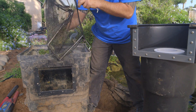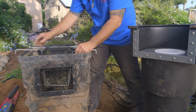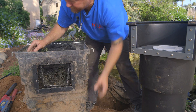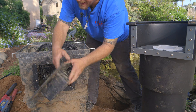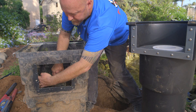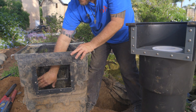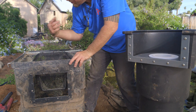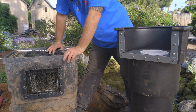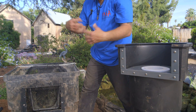Once you got in here, this is the net that you would have to clean — hose it off — and then get it into position. As we put this in, this particular piece needed to slide and attach to the bottom. But oftentimes it would blow back, and debris would come back around and get down to the pump. Fish, turtles, frogs, rocks — all kinds of stuff could make their way down to the pump. A lot of times people would fry their pumps because a rock would get in and break the impellers.